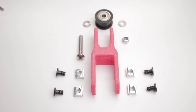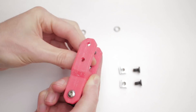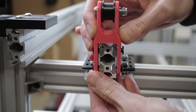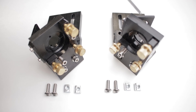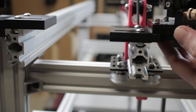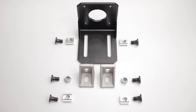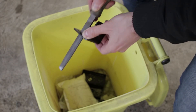Next the x-axis belt pulley. Ironically I didn't leave enough space in my design for the spacers, so future me will need to amend that. Then the assemblies of mirror 1 and mirror 2 — I'll go deeper into their exact placement in a future episode, but for now they can just be screwed in place. And then the x-axis motor mount — the slots were set up to take M4 bolts again so I filed them out so they could take M5s.